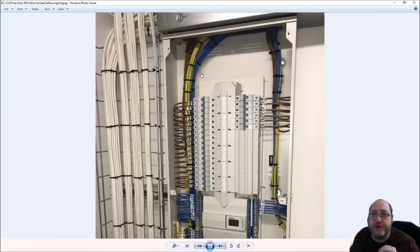So a couple of examples that I'm going to show here. This consumer unit installed here, all the wiring was strapped together on the tray. In the consumer unit as well, they were all strapped together, all the lines, all the neutrals, and it creates a nice looking result. But what I need to talk about is how this impacts the installation's design and how we're supposed to, intend on this to be done. Now, if we have intended for this to be done, great. The designer has accommodated this and it's going to compensate for any impact. But sometimes the designer hasn't thought this ahead, and the contractor doing the installs decided to make the job look good, and they've done it themselves, and that can be a problem.